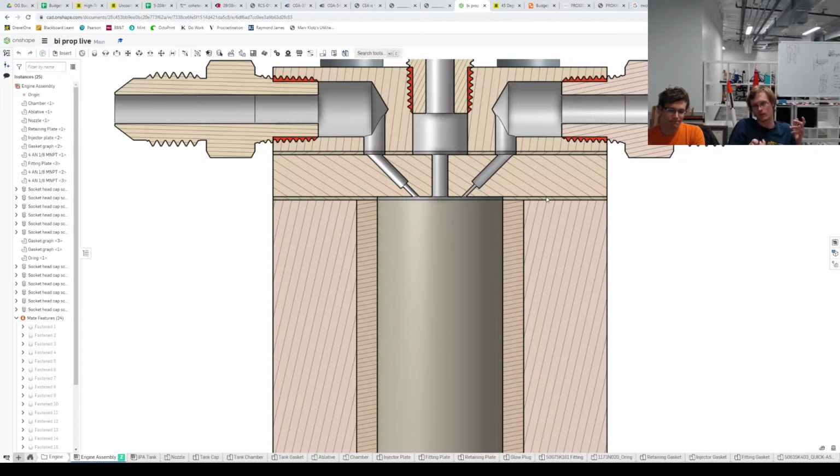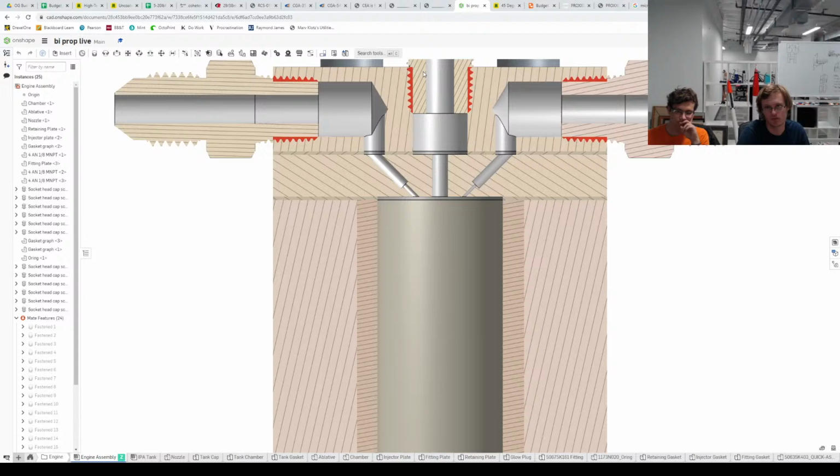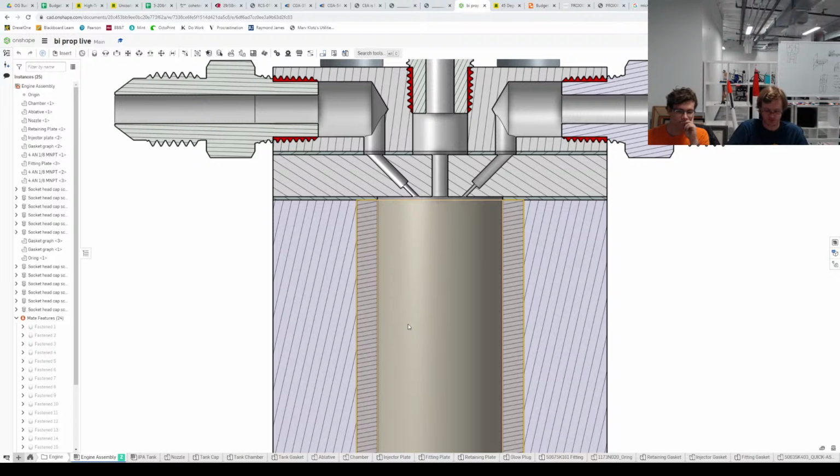Yeah, and this is a 3/4 inch thick disc, so this guy right here isn't a problem anymore because that can easily be a blind hole, a 21/64 tapping size hole down here, and then I can just drill through with a 16th inch drill bit into the chamber for that flow path for the pressure transducer. Oh yeah, that's plenty of thread engagement too.